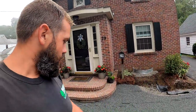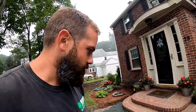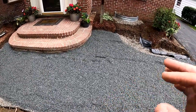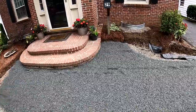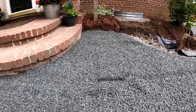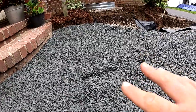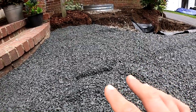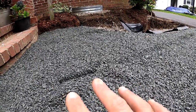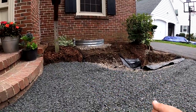We've got it all screeded and I filled in the pipe channels. I just wanted to go over quickly about stepping on the bedding sand — there are a lot of people out there that are really strict about not even wanting you to step on it. I'm a little different: you can definitely step on it. You've got to trowel stuff out anyway. It's really rough where these two pipes met because of the angle, and you can't worry about that too much because it can just kill your production time when you know you can go through with the trowel anyway.